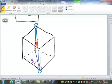So like the length of the hole, let's say you're running 300 RPM at a feed rate of 0.04, 40 thousandths per revolution. So now you can figure out how long it's going to take you to drill the hole. Now we're not going to do that quite right now. Well, why not? Let's go ahead and do it.